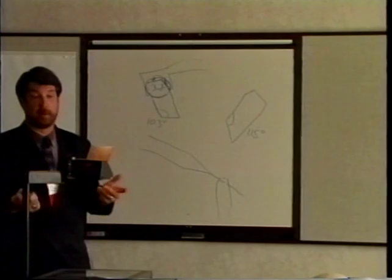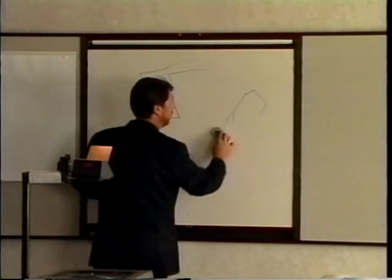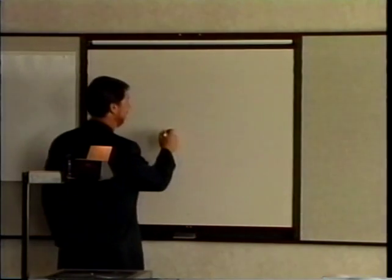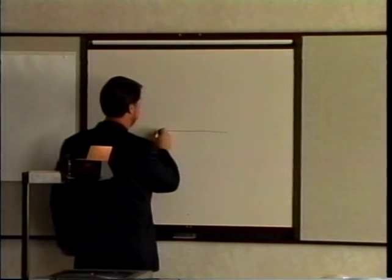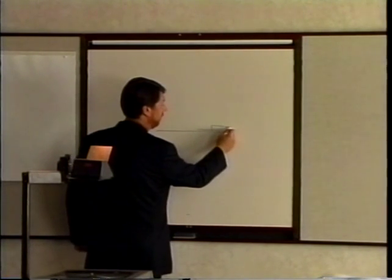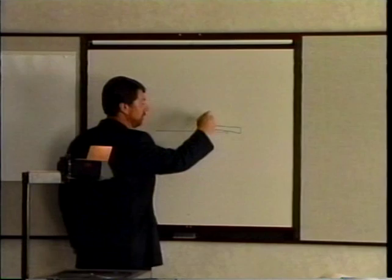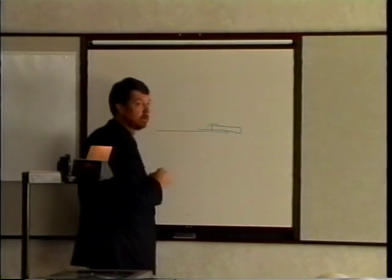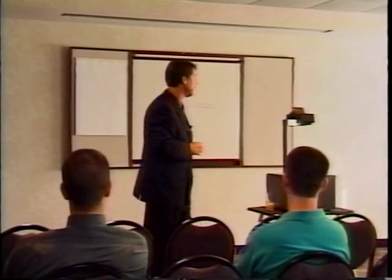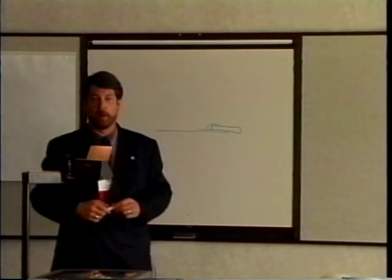Now, if you put your stones in, of course, when you're positioning your pallet stones, and the pallet is laying on the warmer, say this is the thickness of the frame, your jewel's always thicker, like that. So besides the view that I showed of the shellac there, you've also got it like this. Okay. Now, you have to be careful when you have to adjust those pallet stones, either to remove the shellac, what's the best way to remove the shellac?